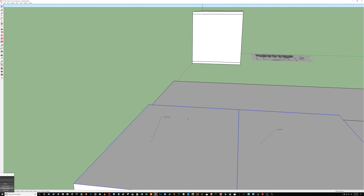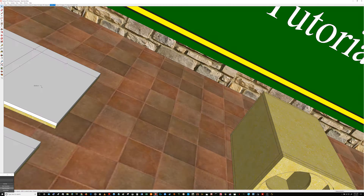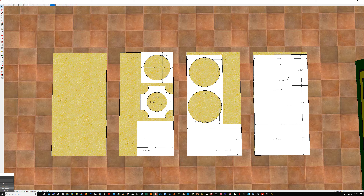You still have plenty of wood to work with, but I don't think you can just cut straight down the center and make all these cuts without running short. In my other model I already compensated for that. Let me show you — I have optimized this for my specific situation. I divided the eight-by-four MDF into four different sections, two feet by four feet each. I knew I'd have an extra piece here to use for my amp rack, and the other pieces were cut from this diagram.